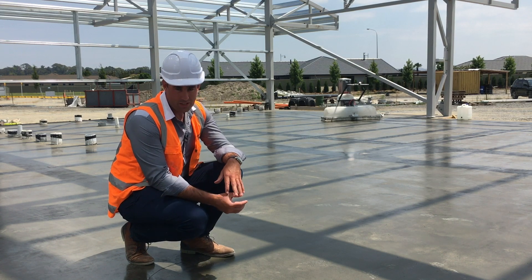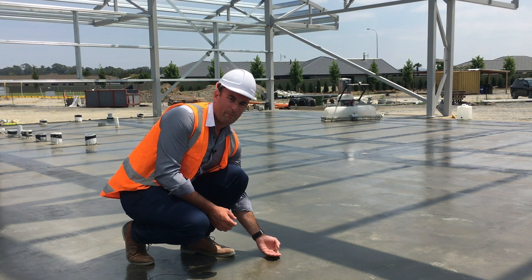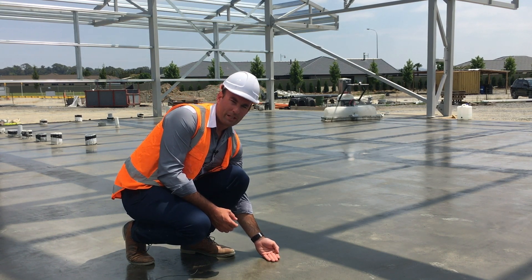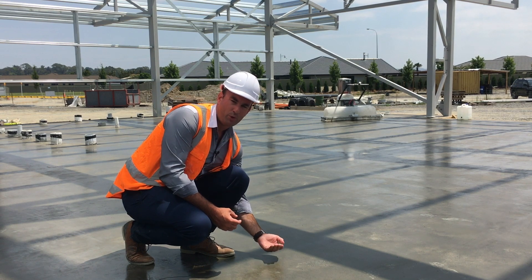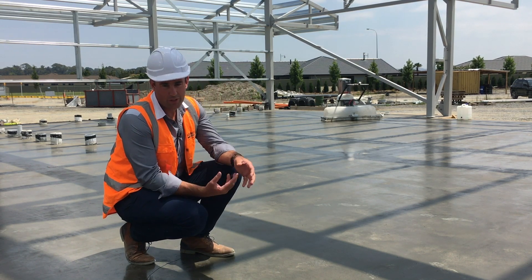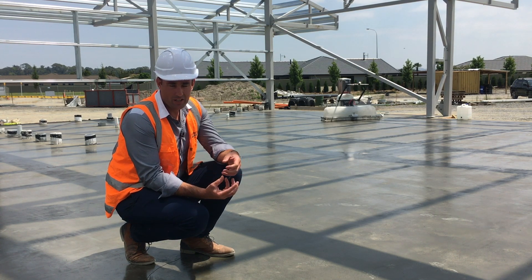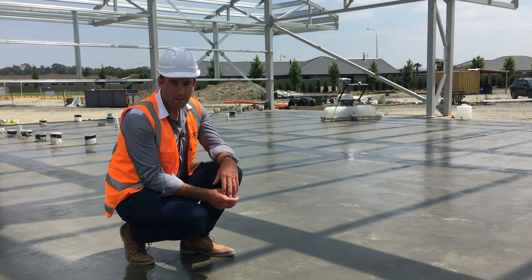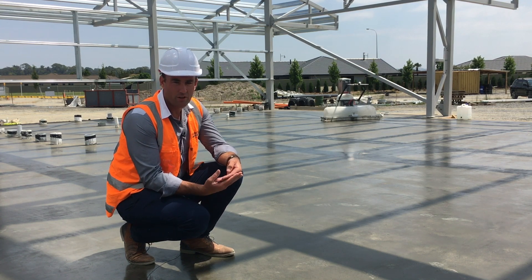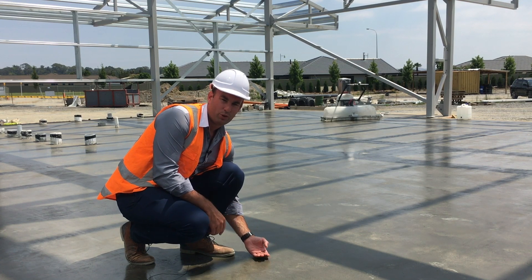So what we do is get involved with a hydrogel treatment to lock in that moisture in the concrete. The easiest way to explain it: the moisture is still there but it's in the form of a hydrogel, so it's still feeding the cement and giving that quality concrete, but it's locking up the risk of moisture migrating to the surface at a later date and debonding the flooring.